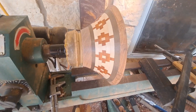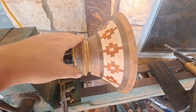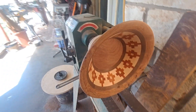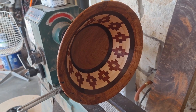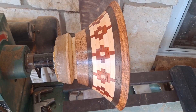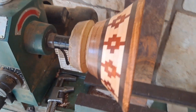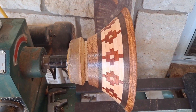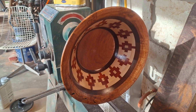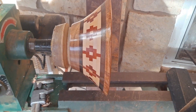It's been sanded and I'm going to wait for the dust to settle, then get some product I've been using — they make a sealer and I'm going to try to seal this first. That's supposed to help, and I wanted to try it, so I'm going to start adding some finish. It's looking good — I just need to let that dry and once I get the other clear coat on it'll really shine. It's not as fast drying as some of the polyurethanes I've used because it's a tung oil, but if it'll help keep the color longer and provide a better finish, I'm all for it. Just got through adding a coat of Waterlox Marine finish over that coat of sealer — now it's a waiting game till this dries and we'll add another coat.